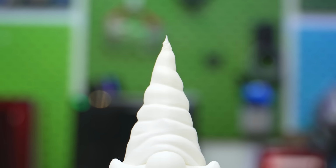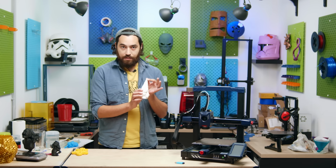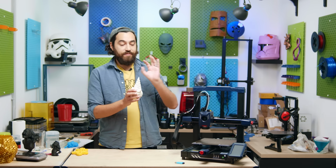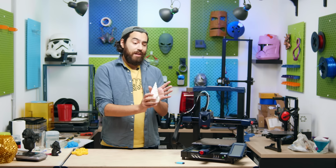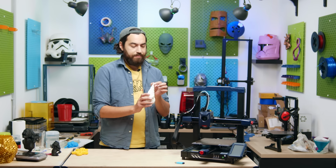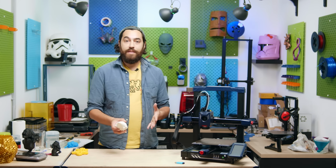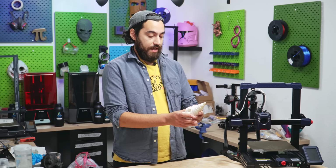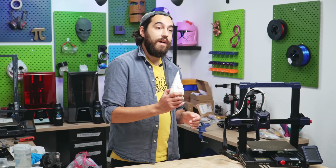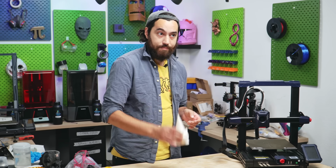And this can be a bit of an issue for high-speed printers in general, because the layer time here is incredibly short, like a few seconds only. So I have this set that the fan would go on to 50% if the layer time was under 6 seconds, I think it was. That wasn't enough. I need to try to do this again at 100% fan speed when we have short layers. So I think that was my issue with the slicer, but you will have problems with high-speed filament unless you have proper cooling, even with ABS.